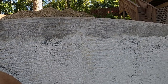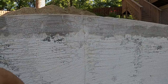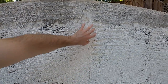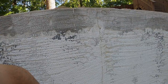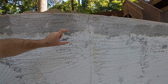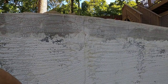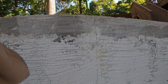I have them on order and they're supposed to be delivered today, so we're going to start prepping this area to install those staples once they show up. The steps we'll go through: first, I'm going to get the demo hammer out and bust down through the rest of the existing plaster back to the gunite, just around this crack, to expose it more and get a better visual. There are two different sizes — one is six inches wide and another is three inches wide. The installation instructions say to space them about every foot, but we're going to go about every eight inches because this crack is a little smaller, and I'd like to get at least four staples on it.